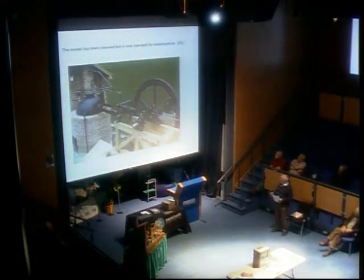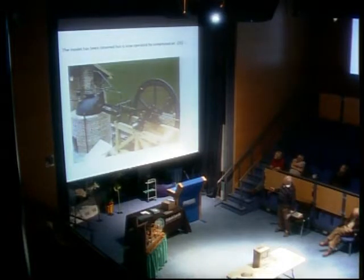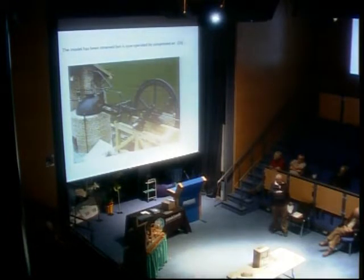So you can see how it's all been put together, the flywheel machined from solid, Richard Trevithick. I know that's perhaps just a bit of modeller's licence putting on the flywheel, but the only reason I put it on is because I could. That's not engraved into the flywheel. If you look closely, that is positive. I actually made a plaster mould with all the letters there. From the plaster mould, I made a polyurethane mould, and pressed car body filler into the polyurethane mould. Because the polyurethane is flexible, they pop out and I dab them on with a bit of super glue.